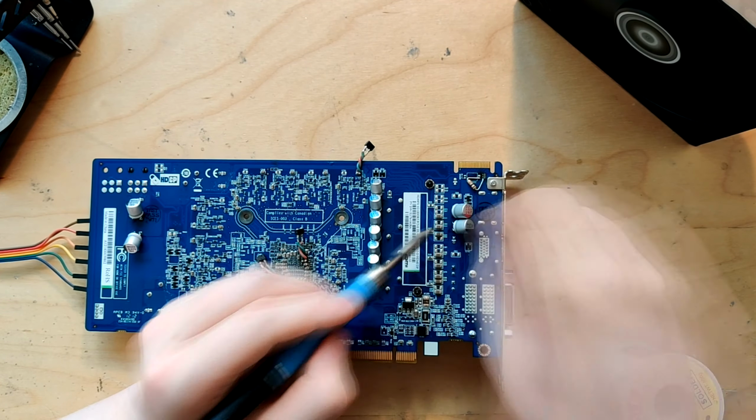The other part was that there actually is a thing such as too many capacitors. In the case of this card, that number of capacitors being 10 attached to its V-core rail. So, these 7 capacitors right here, these are perfectly fine, but the 3 additional ones I had directly behind the core, the higher capacitance ones, well, it seems that having all of those capacitors on the card and starting a load on it actually makes the capacitors, when they charge, pull enough current to shut the card down and trip its overcurrent protection, because that's exactly what was happening. I would boot the card, everything's fine, and then I start a load. Just a GPU-Z render test is enough, and every VRM on this thing would just shut down.